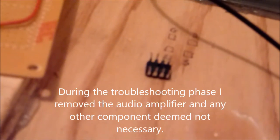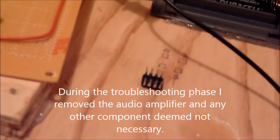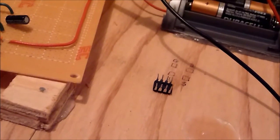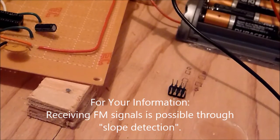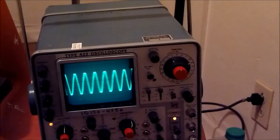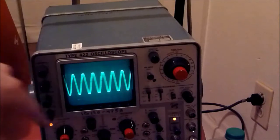Ham band stuff. So I've had a lot of problems and the source of it comes down to this LM386 audio amp chip — pulled that sucker out yesterday. I was getting FM stations and all kinds of different stuff, local FM stations. Pulled it out and started getting Radio Cuba and a couple other ones. I'm trying to hook everything back up like I had it yesterday so we can get that back.